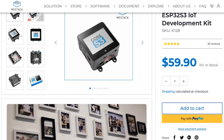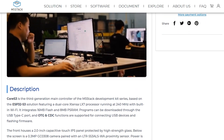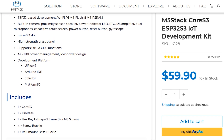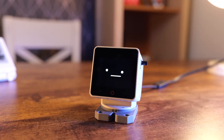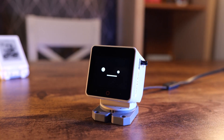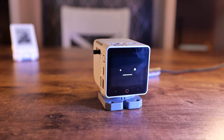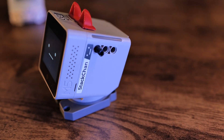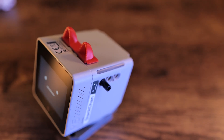By itself, Core S3 is a very impressive development board. It is built on top of ESP-S3, which enables Wi-Fi and Bluetooth 5.0. It comes with a 2-inch touch display - an IPS LCD display with a resolution of 320 by 240. There is a 0.3 megapixel camera, a couple of sensors including proximity, infrared, 6-axis, altitude sensor, magnetometer, RTC speaker, dual microphones and USB Type-C. At the back you've got a GPIO header and a Grove connector to attach even more hardware to it.